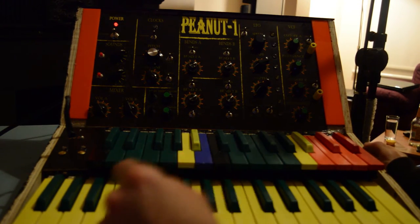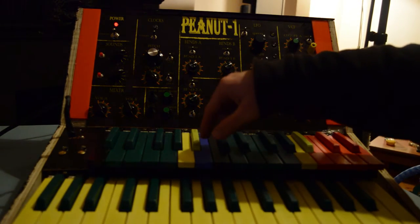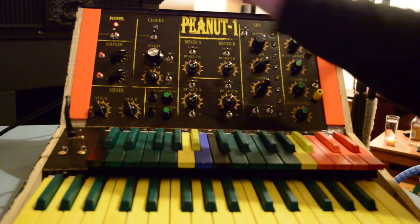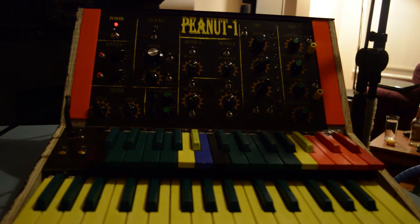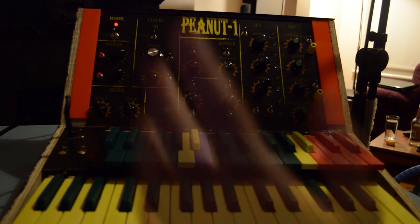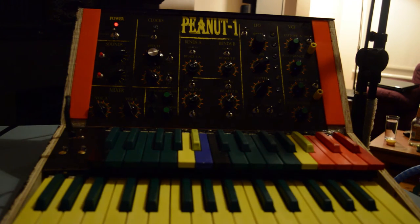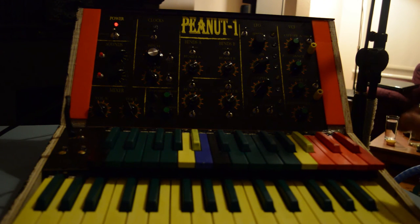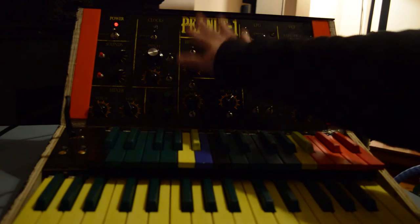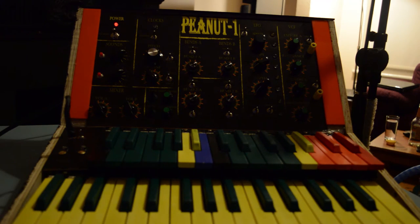One thing here, the blue key on the upper manual basically connects another capacitor to the clock, so it drops down. Here we have four orange keys that are other bands. More detailed information in the second part of the video as well. I will provide some schematics. And here these two red keys add another capacitor to the first band, to the kind of fuzz. So let's now play around with this keyboard a little bit.